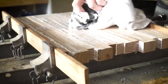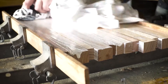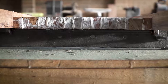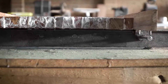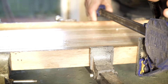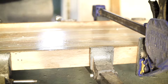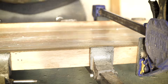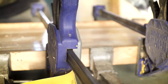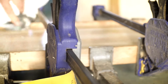Then you can wipe off the excess glue — sometimes I try to push the glue into the timber to make sure it fills any extra gaps. Once you've cleared the glue, check that all the pieces are sitting flat on the clamps. To ensure the clamping pressure is even, grab extra clamps and clamp from above as well, spaced out evenly — this ensures the whole surface area is clamped properly. Then wipe off any extra excess glue that came out after the additional clamping.